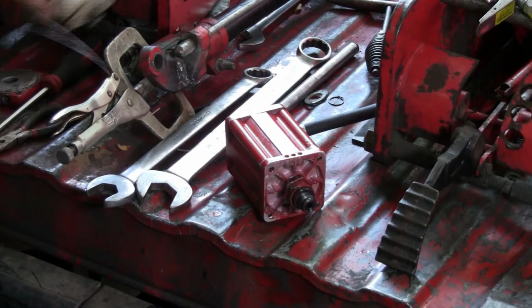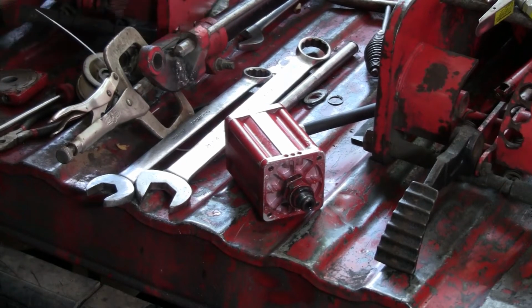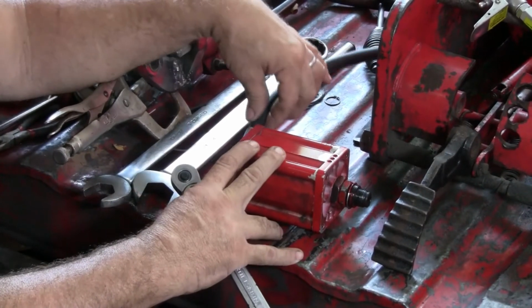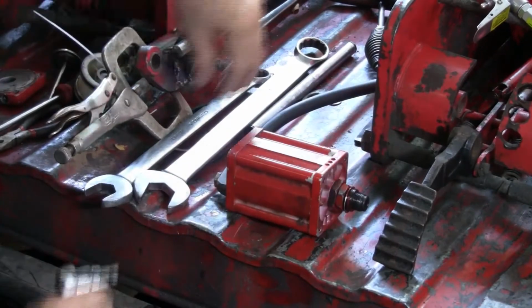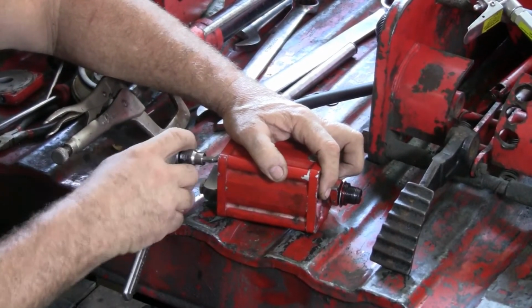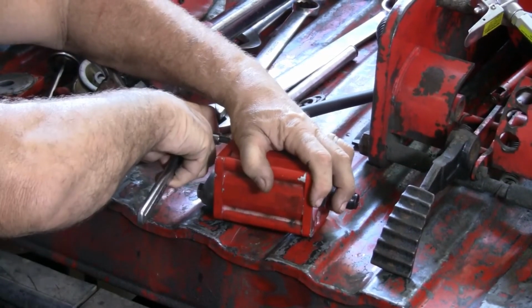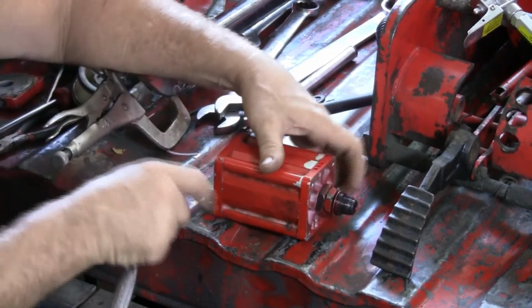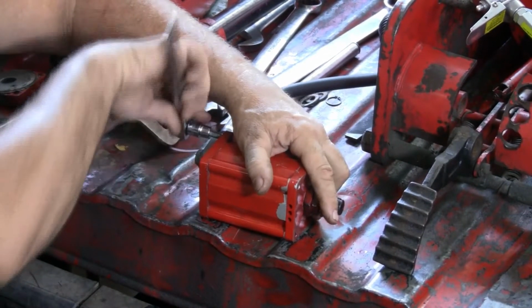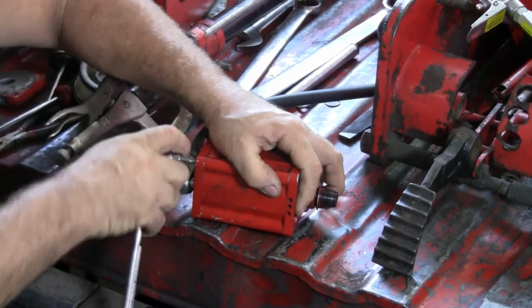So this piston with the O-rings, this is also referred to as a piston, is what's on the inside of here. And this is a swivel air hose. I'm going to attempt to disassemble it and reassemble it so you can know what's inside of it. Now there's a big spring in here, and it's going to hinder you from reassembling it. Not so much on the disassembly, but on the reassembly, that's where it's going to take some coordination to get it back together.